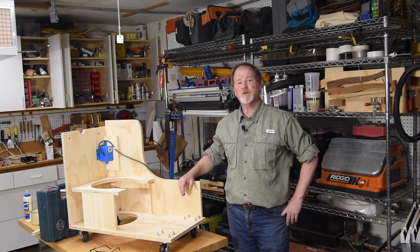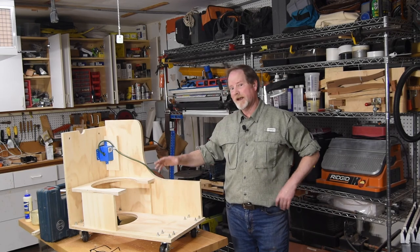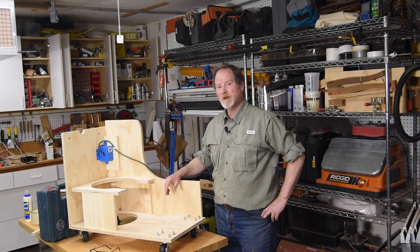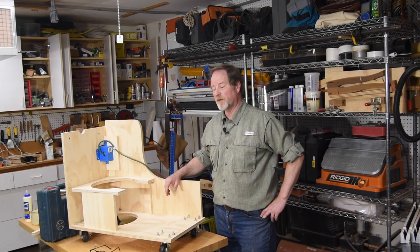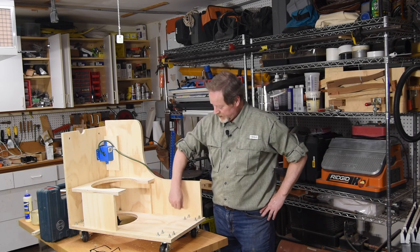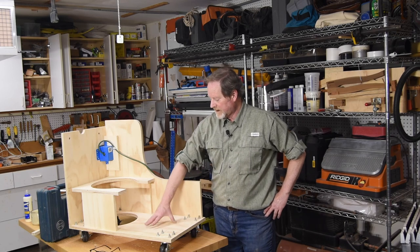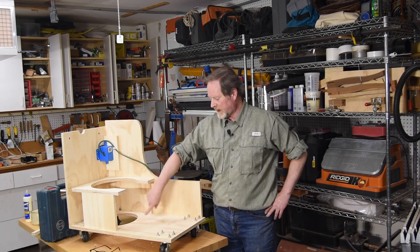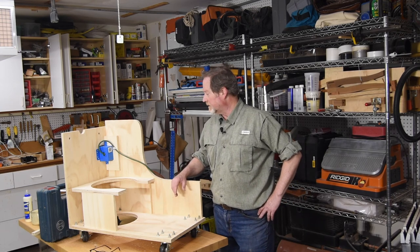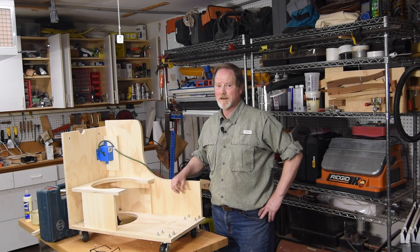Well, I didn't make a prototype. This is the first one, 001. And when I put my Cyclone here and my shop vac here, I noticed that it didn't quite fit right. My solution has been to trim this off, and I did that on the table saw. No big deal. You've seen me use the table saw before. But this little bit right here gives me enough to clear, and that's what I wanted. In addition, for my shop vac, I could have used smaller bolts, but I don't think it matters. I'm going to put a piece of plywood here as a plate to raise the bottom of the shop vac a little bit higher than the top of these bolts. And I think that'll solve the remainder of my problems. I don't see too many other issues with all the fit up. I'm going to get after it and finish this project up.